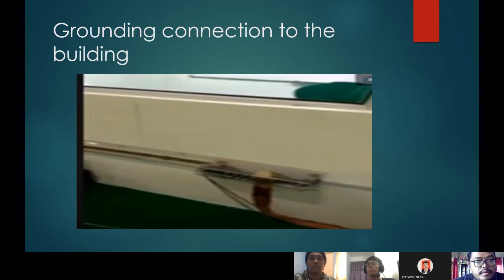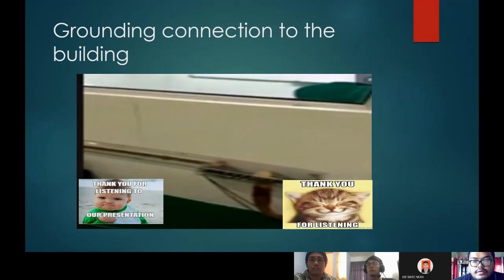The grounding rod depth is not important, but the ground resistance must be below 2 ohms for personal protection. A local construction company can give you more details about the depth of the rod. The grounding rod shall be placed close to the test area. The enclosure ground starts with the connection to the ground rod with a strong copper band, for example in this picture, which has a measurement of 0.3 mm times 100 mm. So that's from me, that's from us. Thank you.